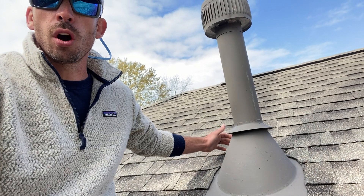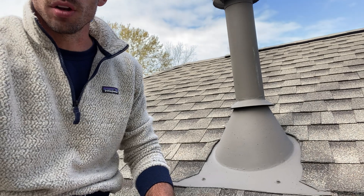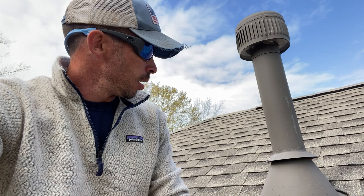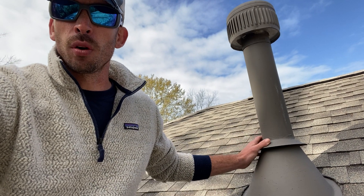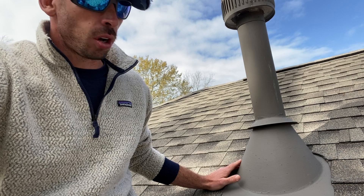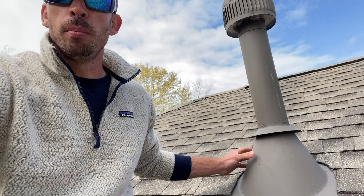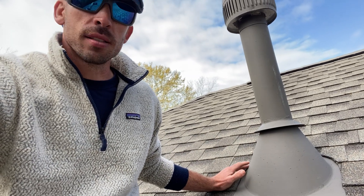This is what the water drains on, and this is what it looks like when we're all done. We don't leave the old rusted-out pipe base flashing — we change this out. This takes a lot of time. It takes one guy about an hour to do correctly: remove the old base flashing and storm collar, take the high wind top off, install storm guard underlayment around the pipe.